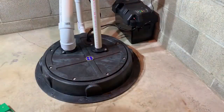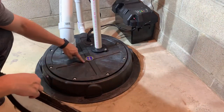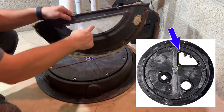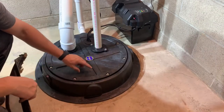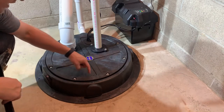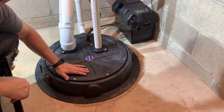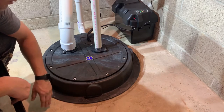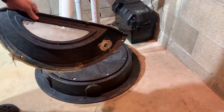Something I really like to do is write the installation date right on my equipment — it really helps later when you're trying to figure out how long a pump has lasted or how long a water heater has been installed. One last thing: the sump pump cover I'll link in the description is the Jackal cover, but they started putting a PVC or acrylic window in the newer version. I'd like to have that window so I can shine a flashlight down into the sump pit and see what's going on — it's really nice to not be completely blind. I plan on cutting a piece of acrylic and siliconing it in. If you order one of these, order the one with the window.